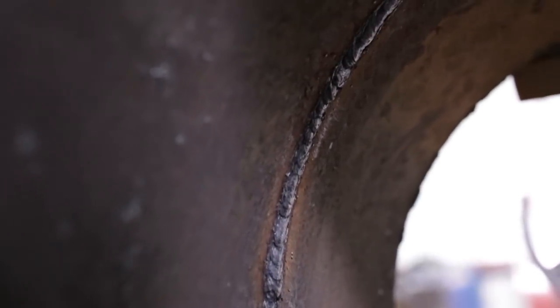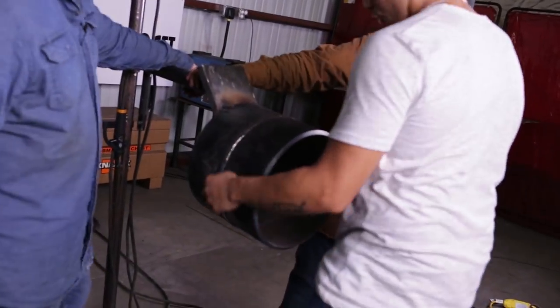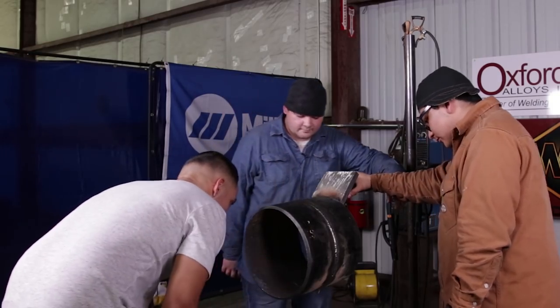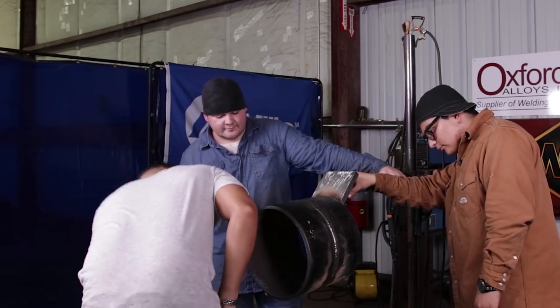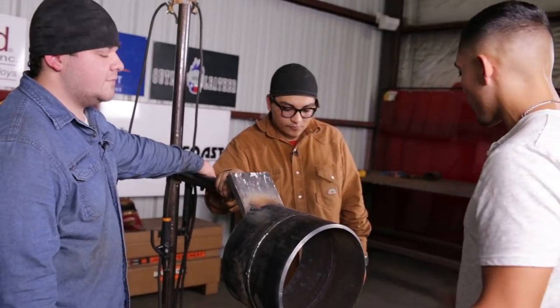You got to remember, we're still in high school, we're still starting out, so not everything is going to look perfect — we're still learning and we've still got a long way to go in the welding industry. By no means are we perfect, we just started, we only had a little bit of time to practice on this and it looked pretty good. I could have done my restarts a little bit better but they're still not that bad. Make sure you get penetration along everything and your tie-ins too. Y'all finished? Yes sir. It looks consistent. I like it. From 12 o'clock to 3 and 9 o'clock looks good. There's one little spot on the bottom side that was a little bit like a lack of fusion — you didn't push all the way through — but it's okay. The bottom side is a little heavy but we can always fix that, especially coming two days out of the week, Tuesdays and Thursdays for the Blue Collar Jumpstart program. It's pretty good gentlemen. Did you have fun? Oh yeah.